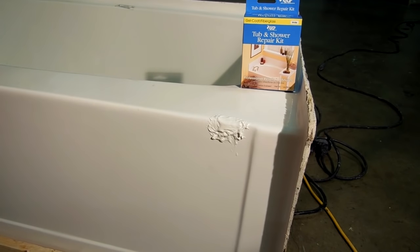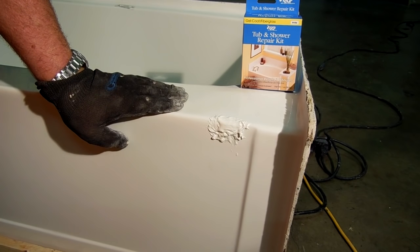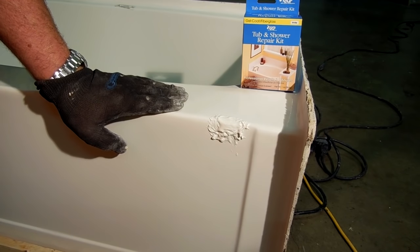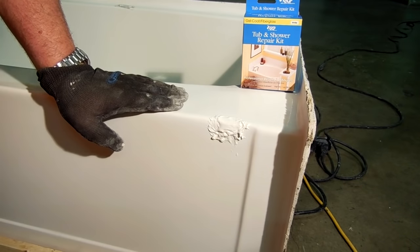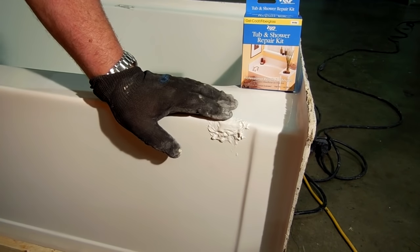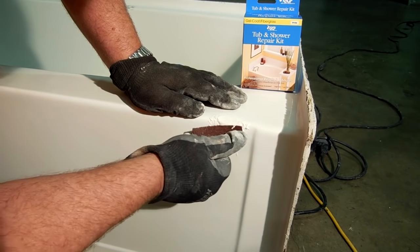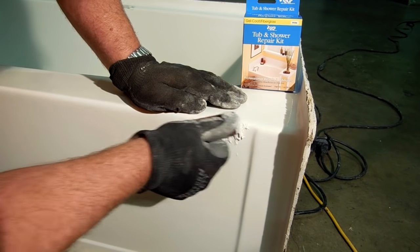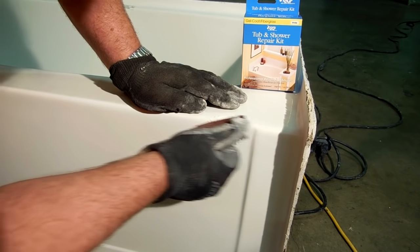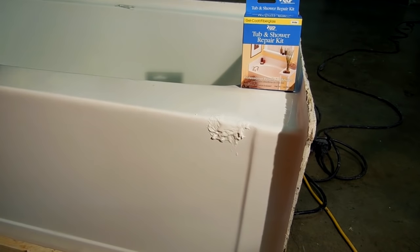It's cured, and I'm going to start with the 400-grit sandpaper to shape this. It may look a little different because during curing the material shrank down more than I wanted, so I added more material on top so I could sand it flush with the existing height of the tub. I'll work it down with the 400, then switch to the 600. One important tip: you don't have to bear down. Let the sandpaper do the work — if you push too hard you could pull the repair right out of the chip you were trying to fill.